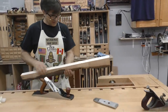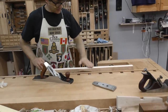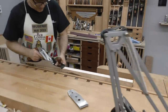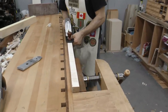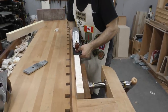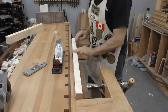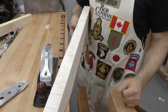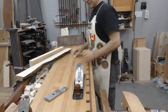Here's a piece of figured maple — some might call it fiddleback — but it's hard maple. It's got a lot of figure in it, you can see it. Same blade, same angle of attack, same everything, with a very, very light pass. I should be able to plane that and get just as smooth a surface as the piece of cedar. Gorgeous. Look at that real close — there's no tear out. You're not going to get it any better with anything else. You didn't have to mess around with closing the throat, just had to have a really sharp blade with a very light pass.